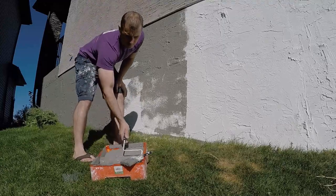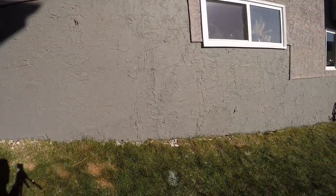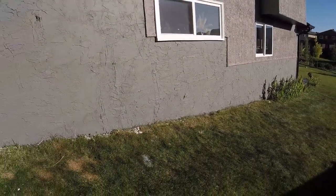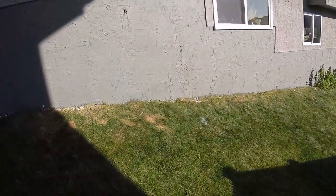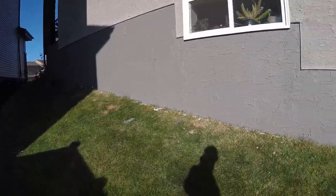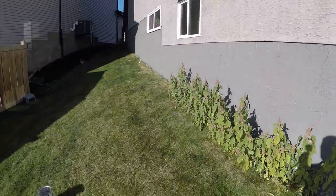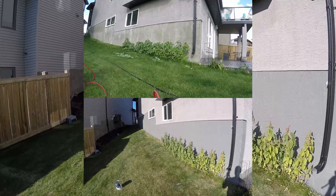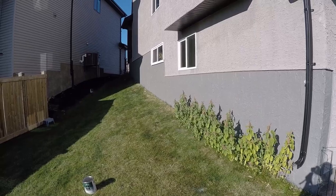Here's the longest and largest wall complete, and I've finished the three other walls with this type of parging on them. The job was pretty easy overall but it took quite a lot of time — you had to wash the wall, put the parging on and wait for it to dry, wait for the primer to dry, then wait for the paint to dry. It took about three weeks to get through it all, even though each individual day's work wasn't very long. I'll try to get a side-by-side before and after. Anyway, thanks for checking out my video — don't forget to like and subscribe.